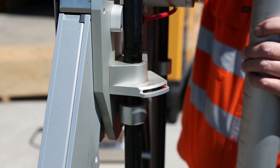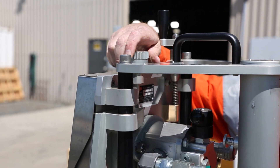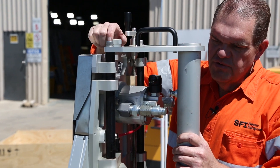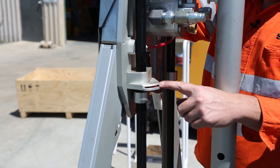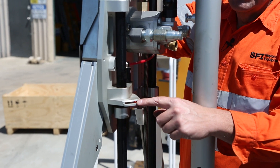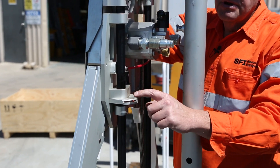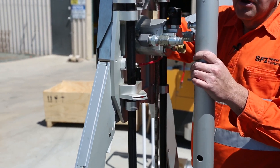This is a tension gauge. Before we start cutting, we'll actually tension the wire up and move that wire up to 'set' before we start to cut. This will need to be periodically adjusted as the wire is used — it will actually gain in length and this puts the tension back on it. So make sure the wire is at 'set' before we start to cut. Then once we're cutting, we operate between cut one and cut two, those two lines there. On the top it says 'cut one' and 'cut two' — so that's very important to keep an eye on.